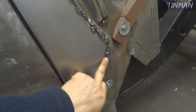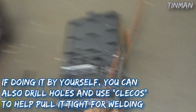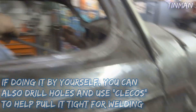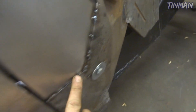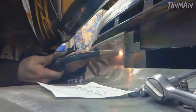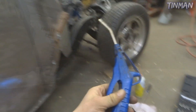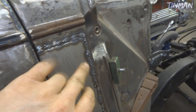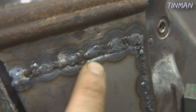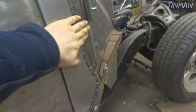This right here is the patch. What I basically did - I did this by myself which is kind of a pain - I reached through the window with a long screwdriver down and around, and I held the MIG gun in my other hand. I pushed it out and worked my way from one corner, pushing down and then moving the screwdriver: tack, tack, tack, tack. So I got fairly equally spaced tacks. Then what I do is go and fill in a little half inch section at a time with the weld, then air cool it fast so the heat doesn't spread around. This usually never looks pretty, but it's more important that you don't let the heat travel. You can see the heat path stops pretty close to the weld. Most importantly - not warping. That panel lines up really good with the door, and the rest of it flows pretty nicely.